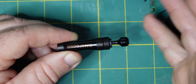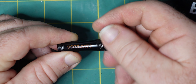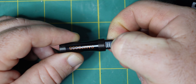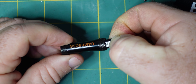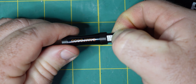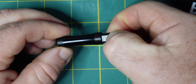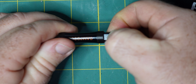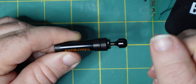Now let's get on with the next one. One of the good things about the Camp Boss compared to the Storm is it can be adjusted on the fly to suit conditions. You screw back the locking ring, which exposes the gauge — you might need your spectacles if you're over 40. It seems to be set to about 20 PSI at the moment. Two full revolutions gets us to about 15 PSI, so one full revolution back the other way gets us to about 17.5 PSI. We want 18 PSI, so about a fifth of a turn more. Then you screw down the locking ring and you're good to go at 18 PSI.